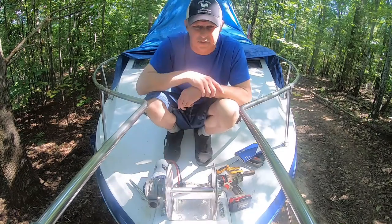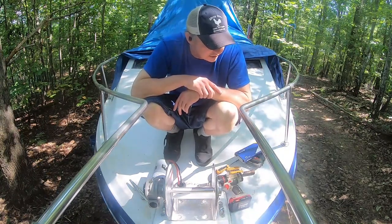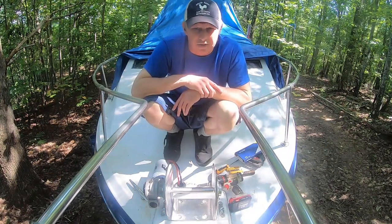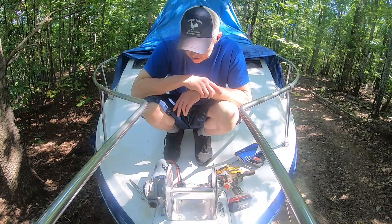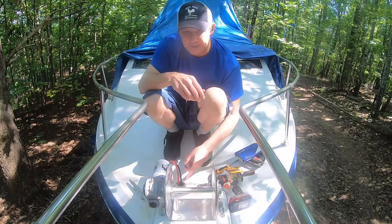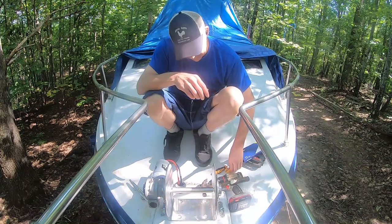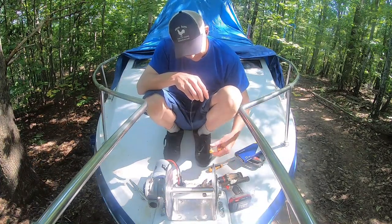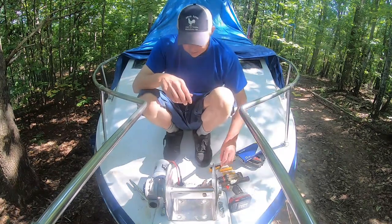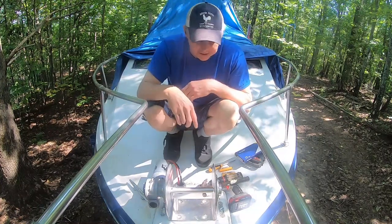That's an expensive fitting. You're looking at like 40 bucks. I had 5 different bit assortments and I couldn't find anything that fit it. So then what happened was, I did it wrong and I had it screwed down and they stripped out. So I came up here with my little shop hammer and a set of hex bits, or stars, the Torx, and I hammered it into the stripped out one enough to get it out.